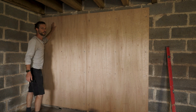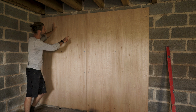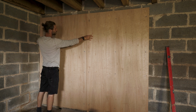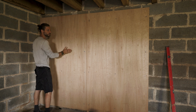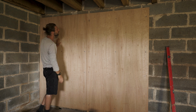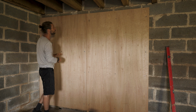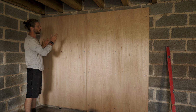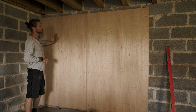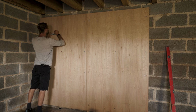Okay, so ideally I want to hang them horizontally next to each other because I could place it like this, 3 together, and then the solar charge controllers underneath it. But I'm afraid of the heat, because if these are working and these are working, it will suck up the heat from the other ones. If I put them next to each other, it shouldn't do that. It takes up more space, but I still have space underneath it for other appliances that don't make that much heat. Where is my pencil?